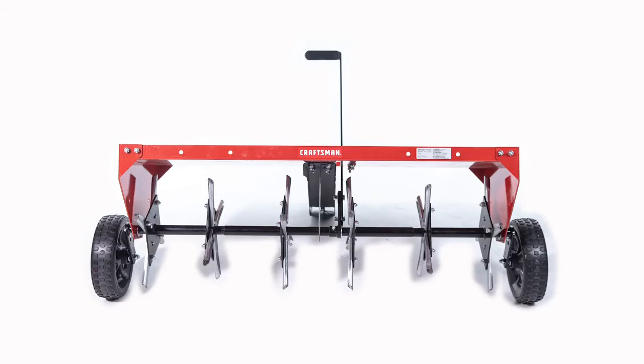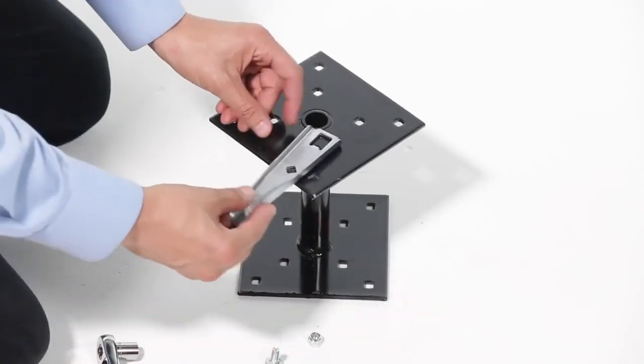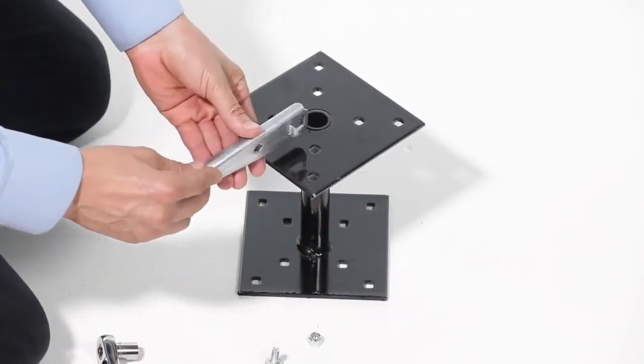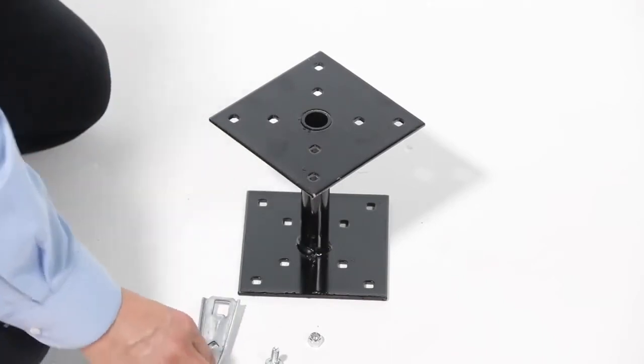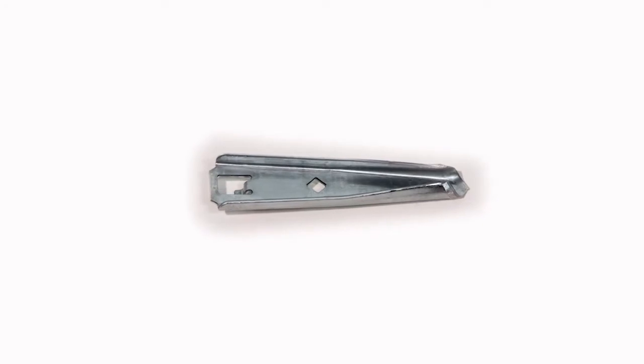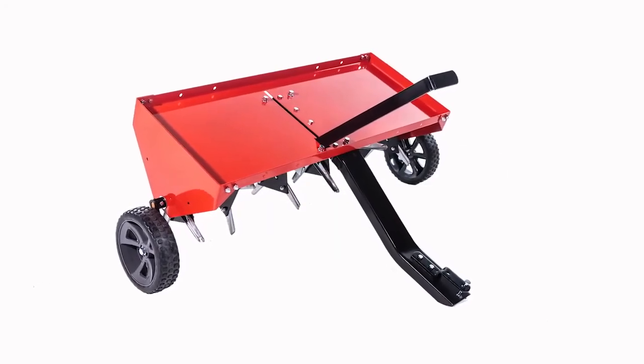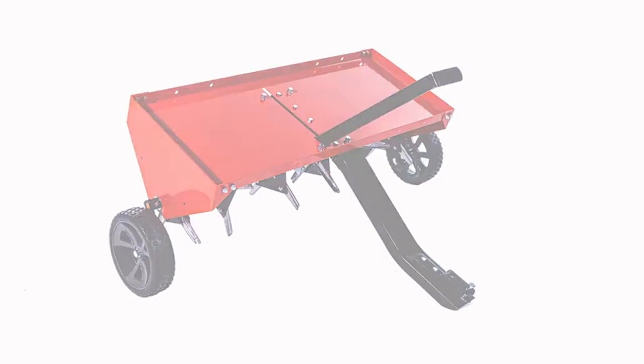Be careful of sharp edges when cleaning. Warning: the aerator knives are extremely sharp — use caution. Plugger points can be periodically sharpened with a small grinder to maintain good penetration. The points should be removed to sharpen. Follow the original angle and contour of points when grinding. Clean the aerator and store in a dry area. Coat exposed metal with light oil to prevent rust.